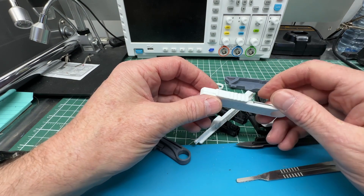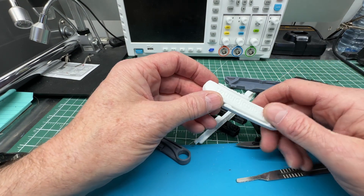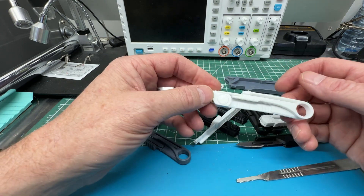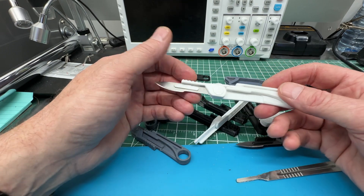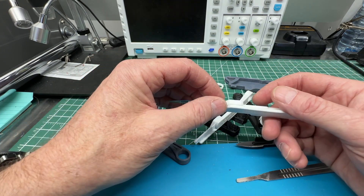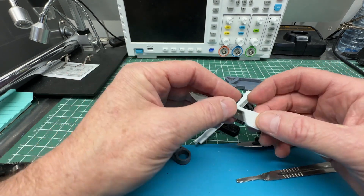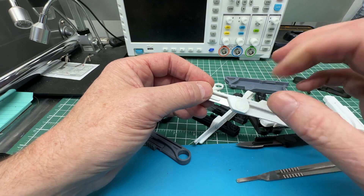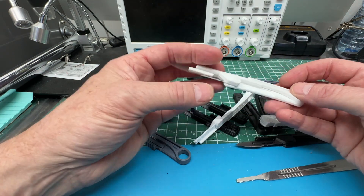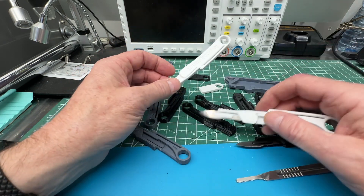You can print it at 100% infill or like me at 40% infill. 100% infill might feel nicer because it gives a little more mass — this thing is super light, only about 8 grams of filament. I did put a void cylinder up inside the pivot so even with partial infill you'll still get lots of walls in the pivot for fairly good strength in there.